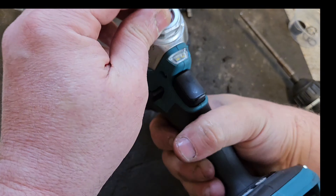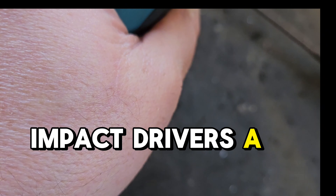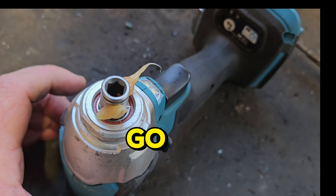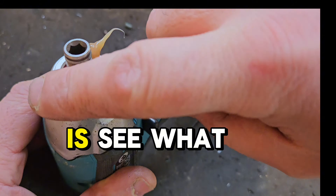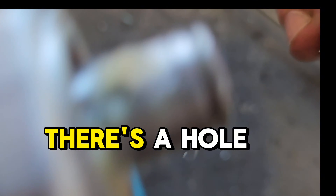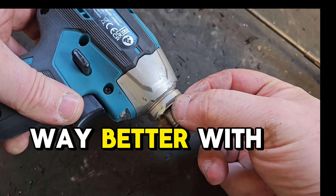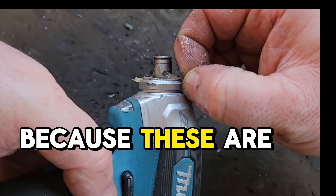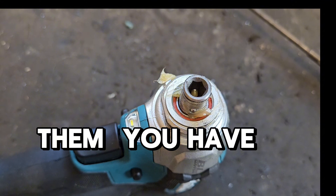That's it together now. We've got to put the chuck back together. Same in any drill and these impact drivers, put a little bit of grease in around the holes where the balls go. Some of these are single balls, some of them double balls — in fact this one is two balls. There's the hole there. Wait a bit of grease on there so that ball won't fall out and get lost, because these are a very unique size to each machine. Now if you lose them, you are finished.